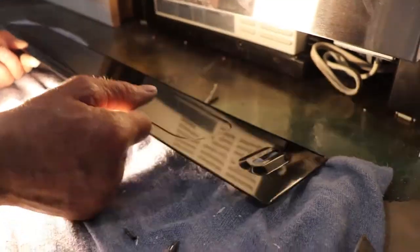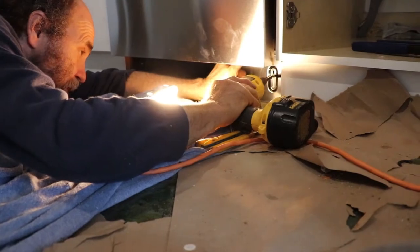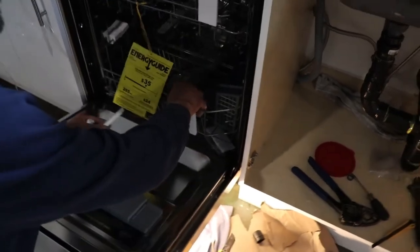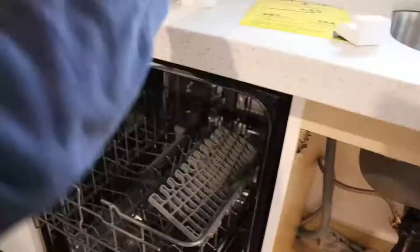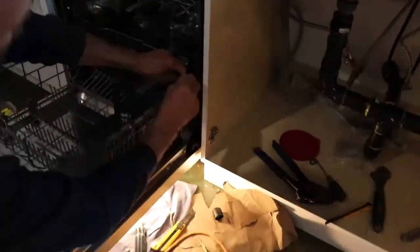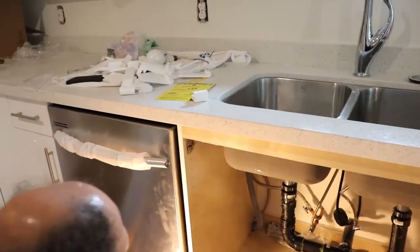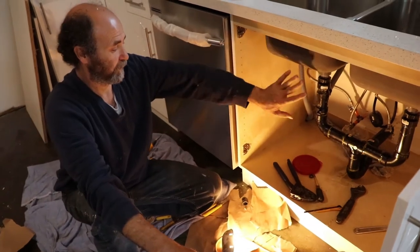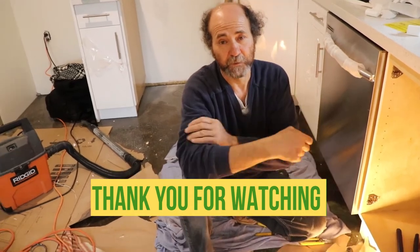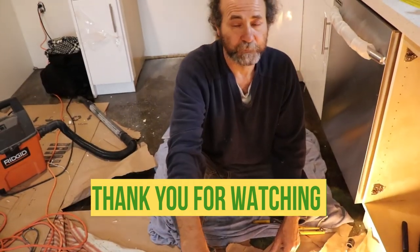You can see there's a big gap on this bracket — so in case your cabinet is a little bit high or you need to put the machine a bit higher, you have about an inch and a half to play with. Find the hole, put it there, tuck it in. This one is done. Clean all this stuff out — once you install a new dishwasher you just gotta remove all the paper and everything that is inside. I remove all the packing material. This one is good to go — we just have to test it. I'll go back in and visually check to see if there is any leak; everything looks good. If you want to see more great videos, please subscribe — we have great stuff coming up. Keep watching and we keep loading. Thank you very much for watching, guys. Thank you for your support — I love you guys, see you soon!